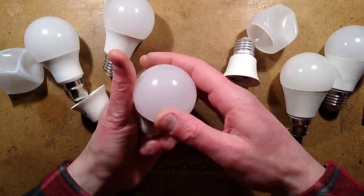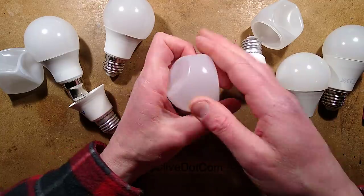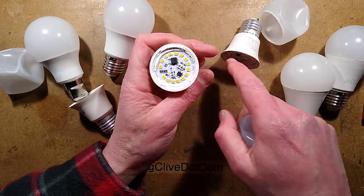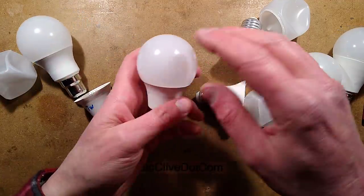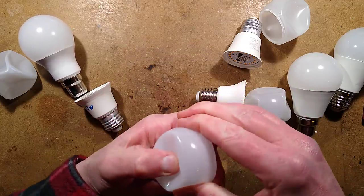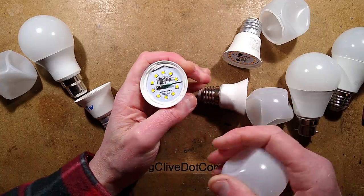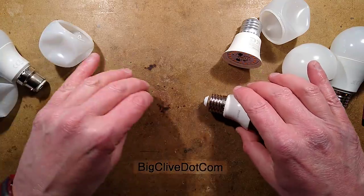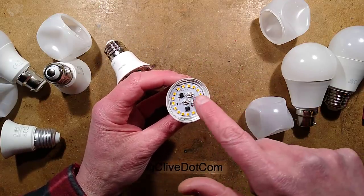Is the Philips one also crushable? Yes, it's crushable - you can reshape the Philips ones as well. As always, if you're doing this yourself, wear gloves and make sure they're not glass. This one comes off - very similar internals: different driver, there's a sense resistor and some resistors in series. Let's do one more - the Hyundai. Yes, this one is crushable too. This one has a separate power supply and current regulation with its sense resistors on top. Back to the original plan - I'll take a picture and show you the components to adjust, then we'll make the modification and see what the power changes to.